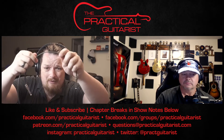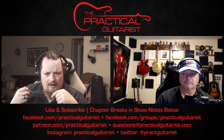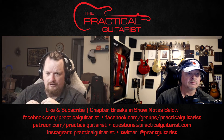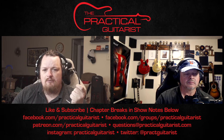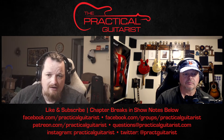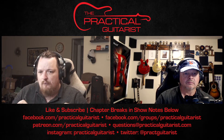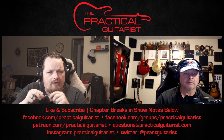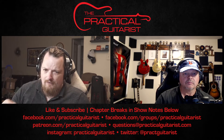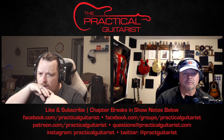A lot of people bend it while putting it together, and it's not solid core. People talk about cable, and Rig Doctor and Paul Rivera both say you want soldered cables if you're touring in any environment with corrosion or exposure to air. I tend to agree — soldered gives you a solid connection that can stand up to more abuse, where the wire isn't moving around pulling on the leads.